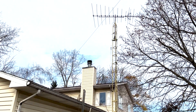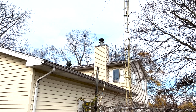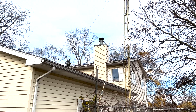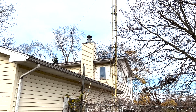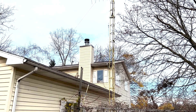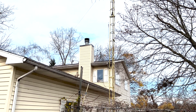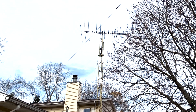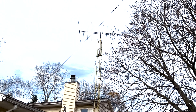Here's the back of the house — you can see my radio antenna and several additional antennas. There's a long wire antenna for the longer wavelength bands. On the roof you'll see a cobweb antenna and a discone antenna. The discone is the one that looks like a star on top of the flat cobweb antenna, and it's used to track the ISS. I've also repurposed an old television antenna as a directional Yagi antenna, mostly for the FM bands.